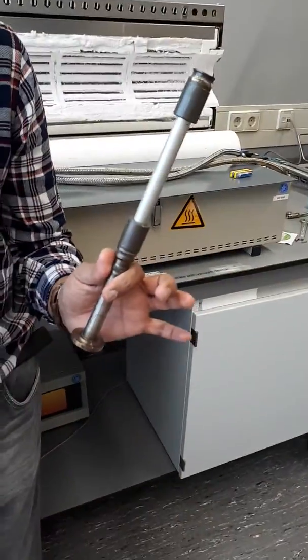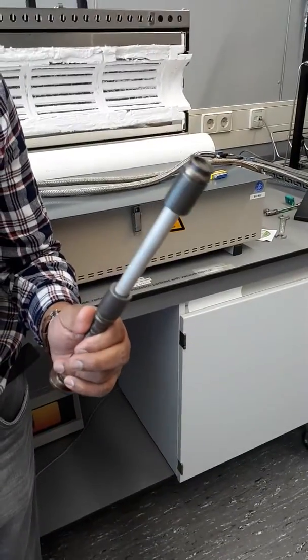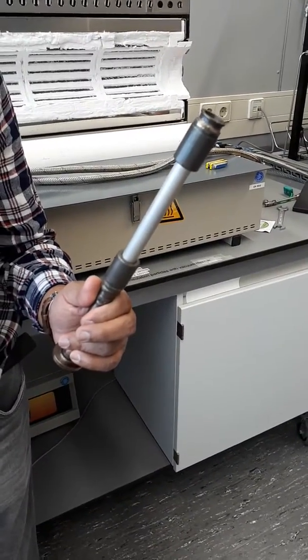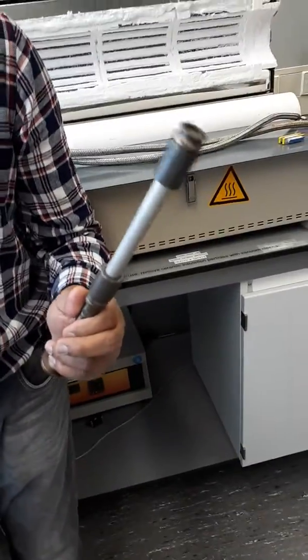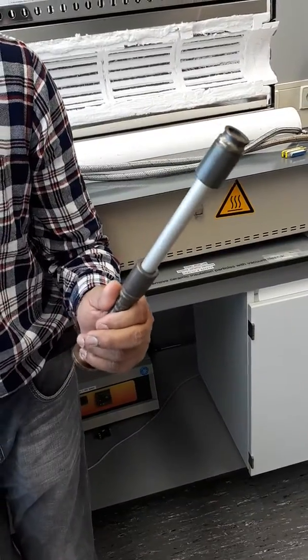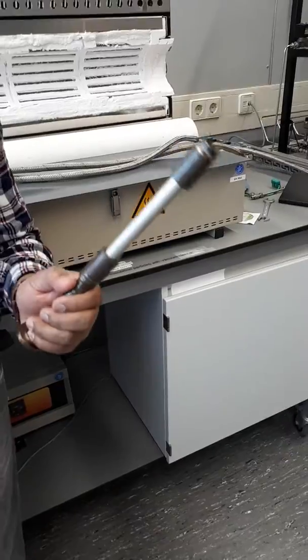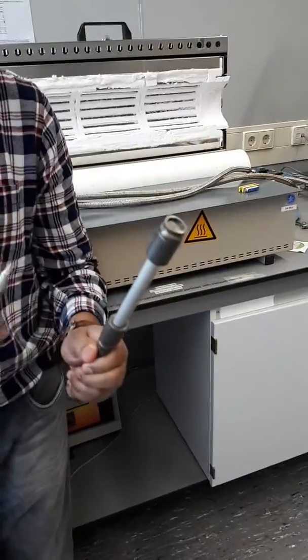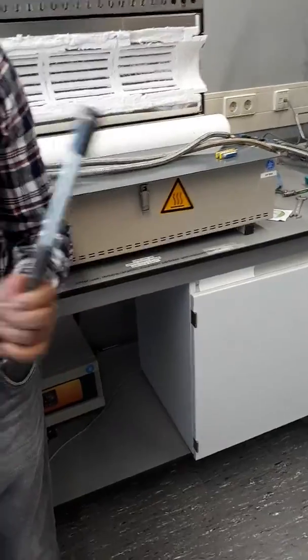This is after the membranes are fixed, or end capped, let's say. Then we use a similar technique to what we used before for checking if the membrane is good or not. But this doesn't mean that there is permeance. I'm not talking about the permeance. I'm only still talking about the leakages. If there are any leakages somewhere in the membrane or not, that's it, and nothing else.